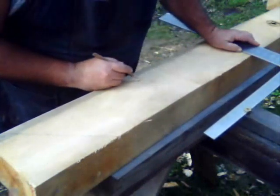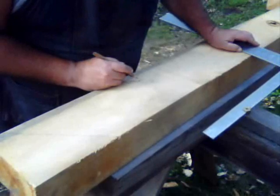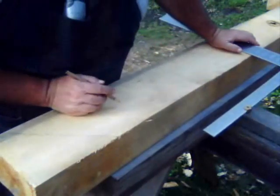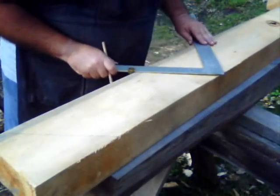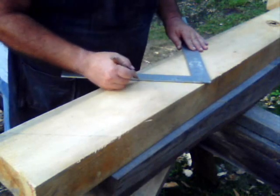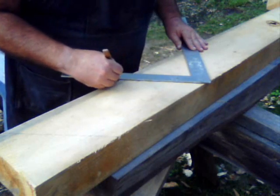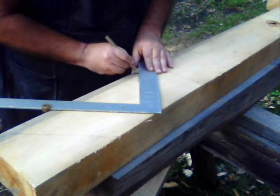At this location I would like to cut a bird's mouth for a rafter seat. This is so many inches down from the top according to the plan. I place my framing square with the buttons and bring it to the cross hairs, because it has to be down so many inches from the top. There is my plumb cut. I slide it over — here is my seat cut.